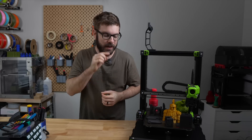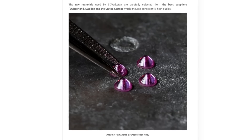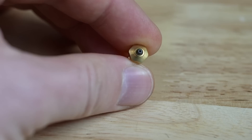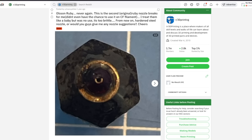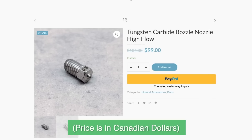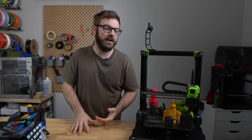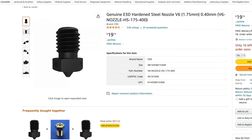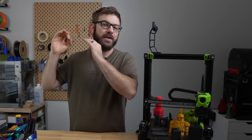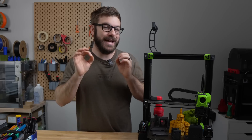Overall, I've really enjoyed using the Basel nozzle. One thing I really like is that compared to other premium wear-resistant options that use just an insert for the tip or have some kind of coating, this entire nozzle is made out of tungsten carbide. This means you don't have to worry about the tip falling out — which I have seen happen — or a brass throat potentially getting damaged. At roughly $80 USD, this is definitely up there in price. If you're only occasionally wanting to print with abrasive filaments, a hardened steel nozzle for a fraction of the cost will be plenty. However, if you print with a lot of or primarily abrasive filaments and don't want the hassle of swapping out plated copper or hardened steel nozzles, the Basel nozzle is a very solid option.